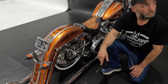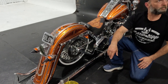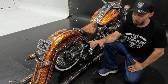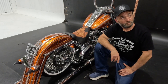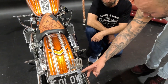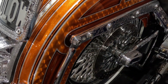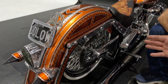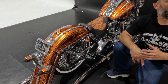Did you have to reset the angle? No — you mount the bottom, mount the top, and you make the piece that goes in between to fill in the gap. You've got to make an internal sleeve because the material's very thin, weld it all up, then grind it and the chrome shop does all the polishing and chroming.